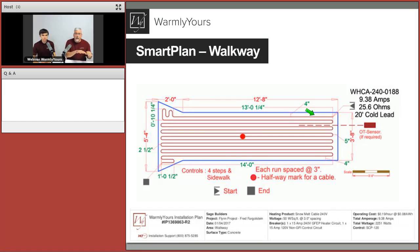If they move independently, you don't have to worry about that wire severing as it runs from one to the other. If you've been around the block a couple times and looked at sidewalks, sidewalks over the years don't always end up being exactly straight. You'll walk down an old sidewalk and you'll see one sidewalk is up higher or one is down lower, it's twisted, that sort of thing. Any of that kind of motion can sever the wire inside because the wire is being held in place. And when it has to go to a different section, as soon as that section moves like that, that wire just snaps, it's severed.